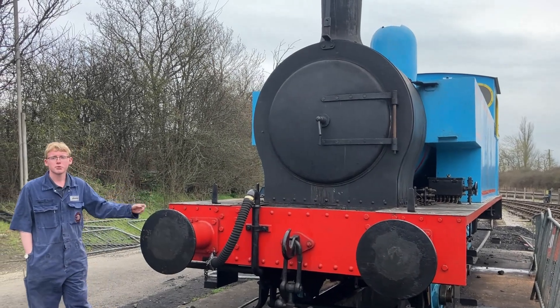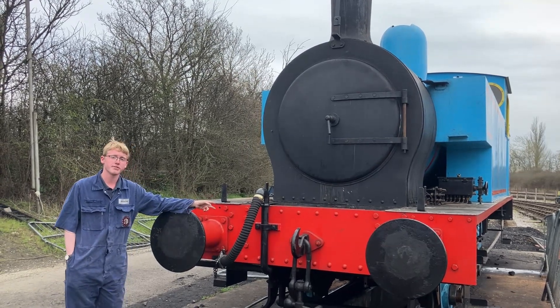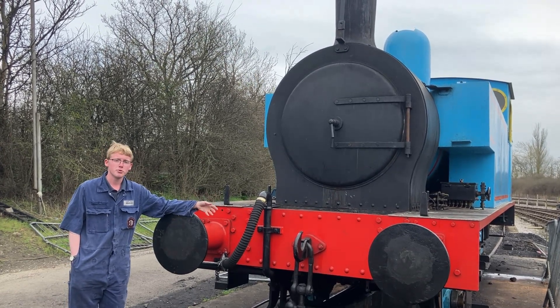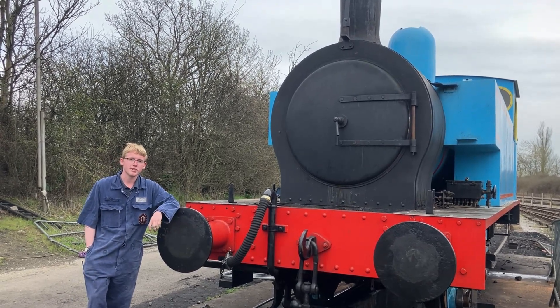As you've seen, we've been washing out Arthur's boiler here. We started from the top of the firebox at the far end, making our way to the front of the smoke box and eventually going down to the foundation ring. This is to ensure that we have got the boiler clean of any scale or any impurities in the water, which now we're confident we have. We've boxed it all back up, ready for a steam test. Thanks for watching and we'll see you again soon.